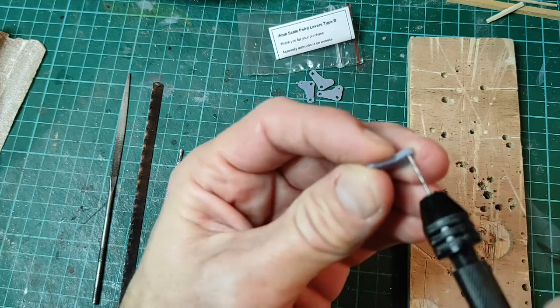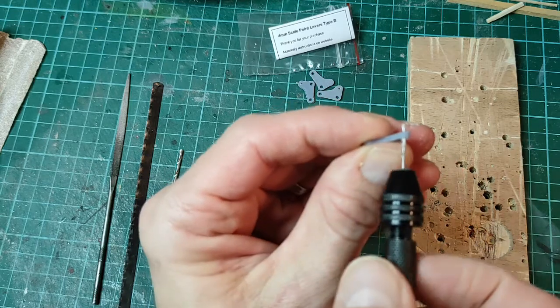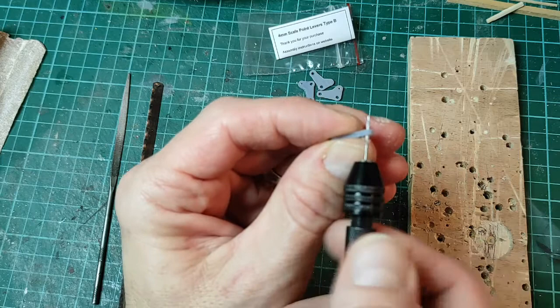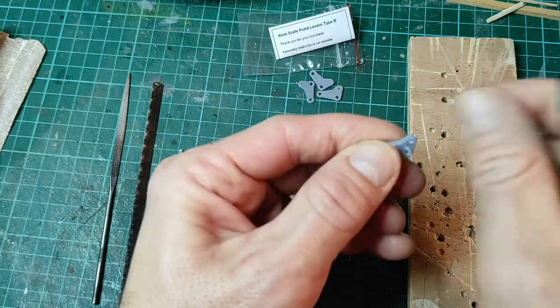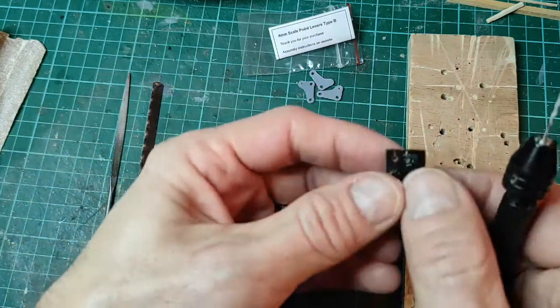So in that 1mm hole, we're going to be a bit naughty. Rather than just drilling, we're now just going to angle it along the length, just to turn this into a slight slot. Because when the lever goes through, you can see it needs to be able to move through an angle. That was slightly exaggerated, but we do need it to be able to move slightly.